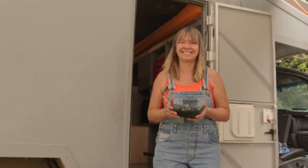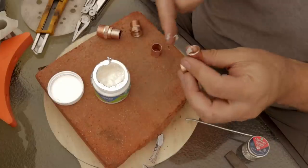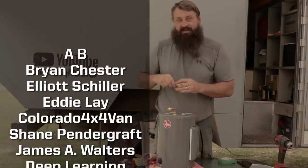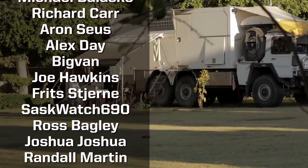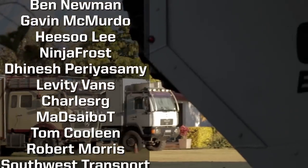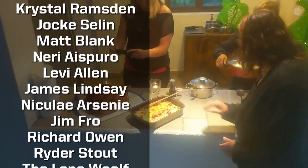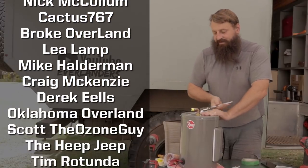Now we need to cut up some copper pipe just to join these brass and copper fittings together. Need to solder this L-bracket in there just to make room and some nice clearance under there, and then thread these in. I'd like to take this opportunity to thank all of our supporting channel members — I know it's been a few weeks since we've put out a video. We've been camped out here with giants of overlanding. Several big expedition trucks from Europe have rolled in from Germany, Switzerland, and Holland. We made a turkey supper for Christmas — several of those people hadn't had turkey before, which was neat to share. But time to get back making some videos. We've got these fittings all in — now it's time to head in and install it.